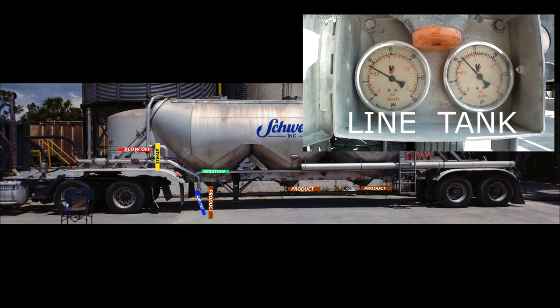If not, wait until it does, and just repeat the process for the next pods, but this time leaving all aeration valves open. Close product valve, close air line, build tank pressure back up, open air line, open product valve, let gauges drop PSI, and repeat for the last pod. And once I'm done with this trailer without separate aeration valves, I will show you the final clean out process, same for both trailers.